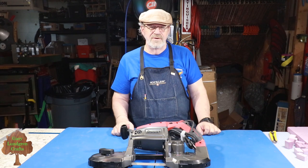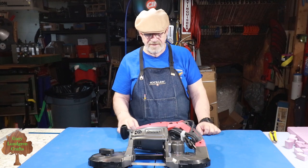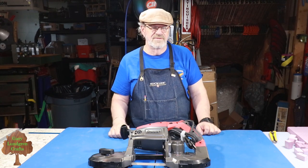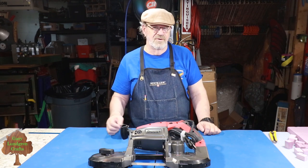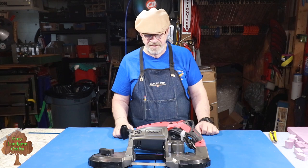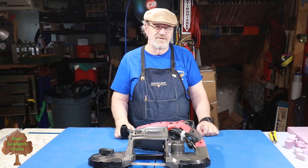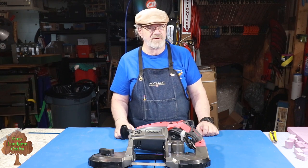Now I'm going to show you a few example cuts with this bandsaw, and also using round disc cutting blades on a handheld roto-zip and on a chop saw. With the chop saw you can cut accurate 45-degree angles and so forth. You'll see the difference in the sparks these tools throw out — and when they throw sparks, don't have any flammables nearby. Be safe.